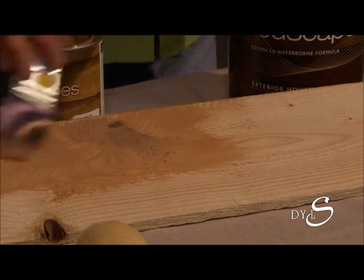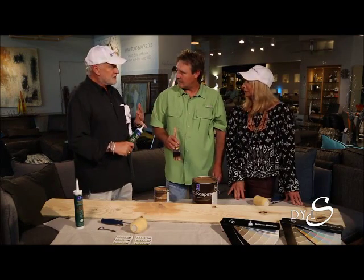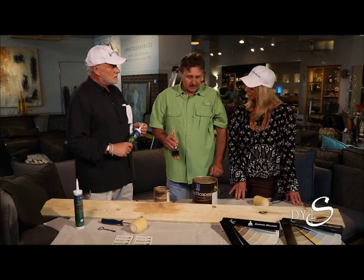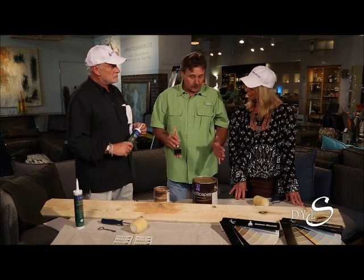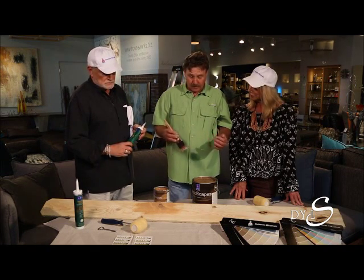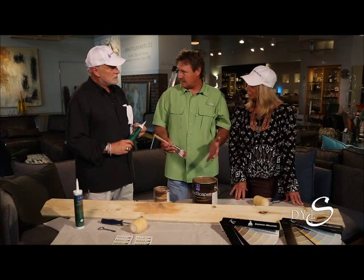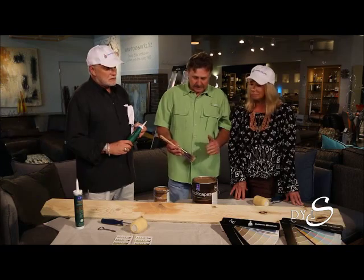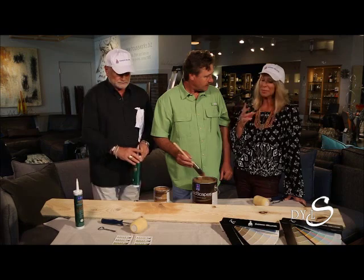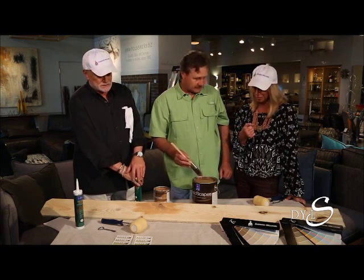Or if you want to go darker, it covers up more. Maintenance of your fencing is really important — you want to keep up on the fencing as well as the rest of your house. Fences turn black after a while just due to UV from the sun. If one's gone too far, not been maintained, that's when you step into the solid-bodied stains — that's for the not-so-favorable fencing. The best maintenance tip would be: keep them sealed.